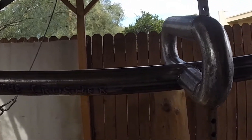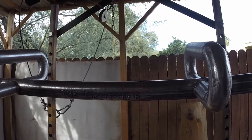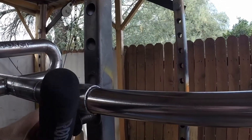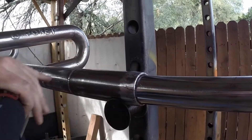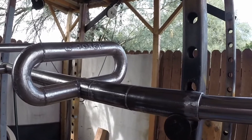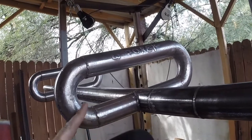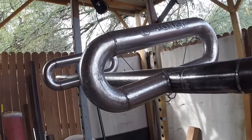There's your other stop collar, so you slide plates on that end and it stops it. Slide plates on the other end, and you can put a collar on both ends to keep the plates from falling off — that'll also lock your handle into the middle so it's not going to go anywhere. I decided not to use pins and things like that because it'd just be more difficult to design and more things that could fail. I taper-fit the ends of the handle right here — I cut that, welded it, and tapered it so it fits to the bar a little snugger. It works out pretty nice. I apologize for a little bit of roughness on the handles, but I smoothed everything up pretty good and I don't think there are any snags.